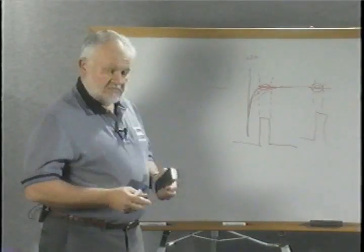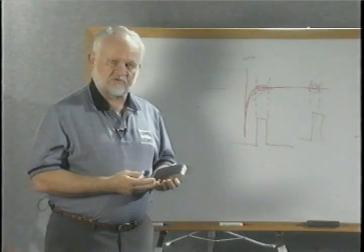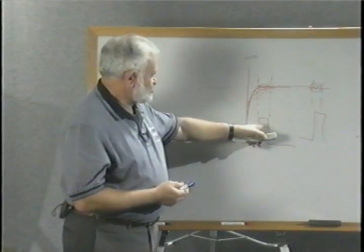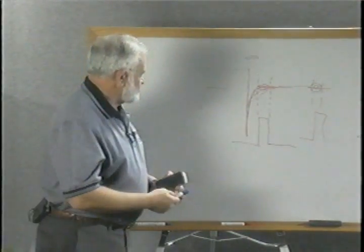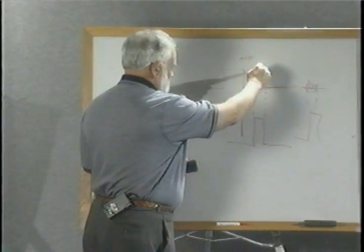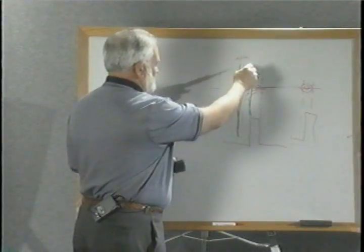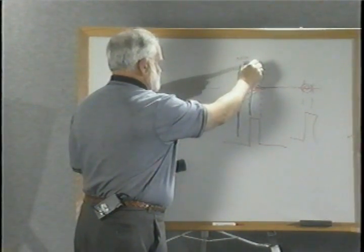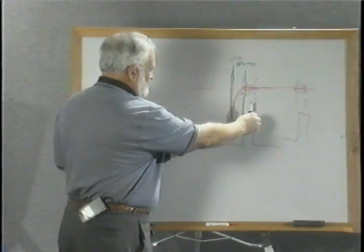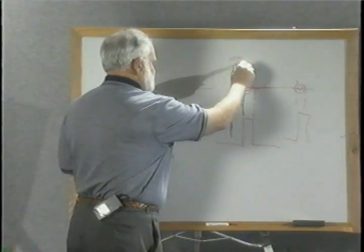With the new PI detector, to increase the sensitivity, we've increased the overall gain, and we've moved the position of the sampling pulse. On the original detector, the phase compared to the falling edge here was about 20 microseconds. That's 20 millionths of a second. We have moved this now to a sampling point of 15 microseconds.